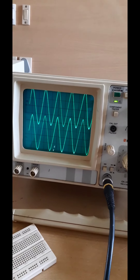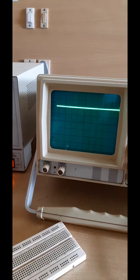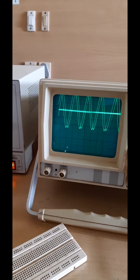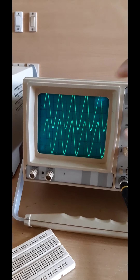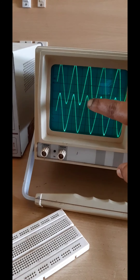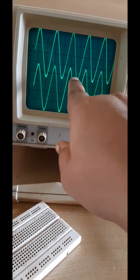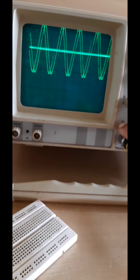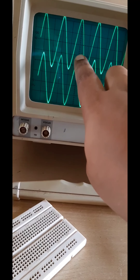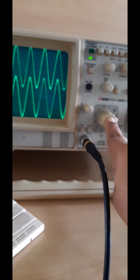You can see here that the common ground point is this one. You can see this is the ground point — now whenever you release the input waveform, you can see it. And again when you release the output waveform, you can see that the output waveform is clamped to the negative side. We have to calculate the voltage. This is the ground reference, and this is clamped to this point. That voltage is 1.2 divisions, 1.2 into 2 equals 2.4 volt.